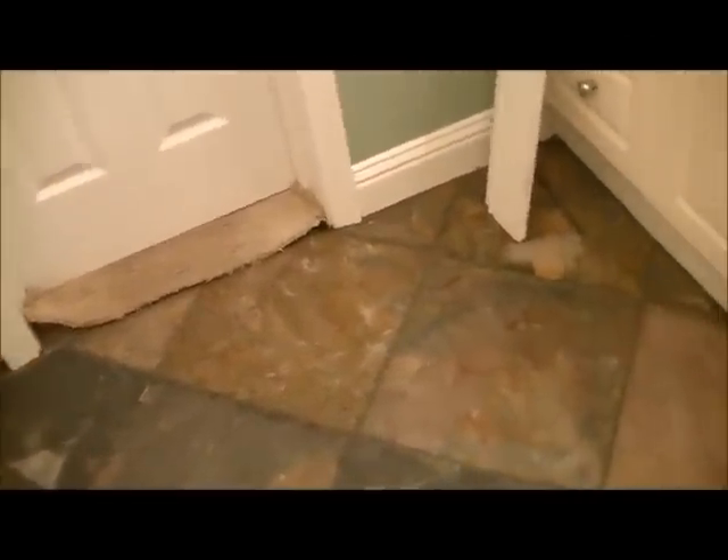There's a transition strip at the end and the carpet is going to get tacked down eventually. There's a little closet over here which has got some slate in there too. It just got grouted, so some of this grout is a little darker, but it is a gray grout and all the haze will come up after it's washed off. The transition we made from diagonal — all this 16x16 on the diagonal — transitions into 16x16 straight into the toilet closet area, and I used some of this 2x2 slate trim tile as a transition from the diagonal to the straight.